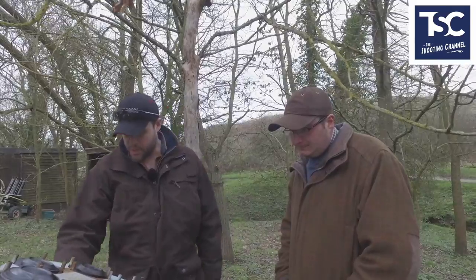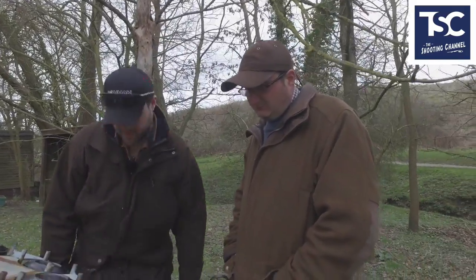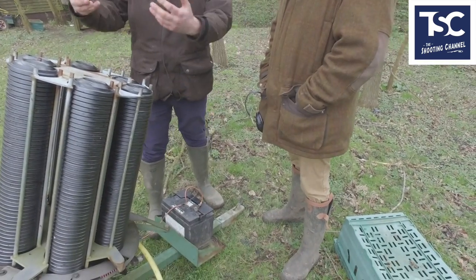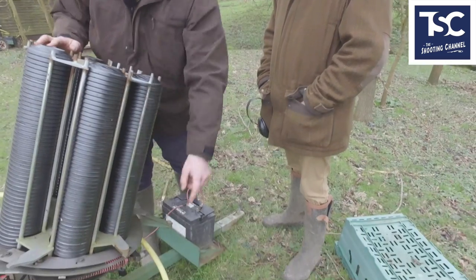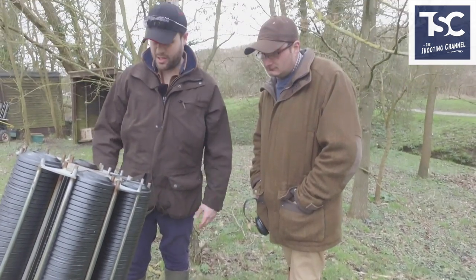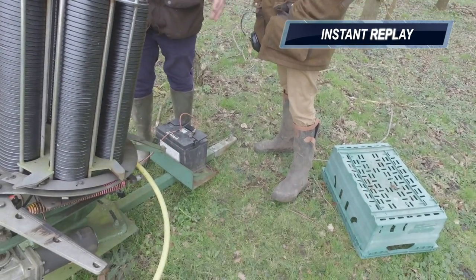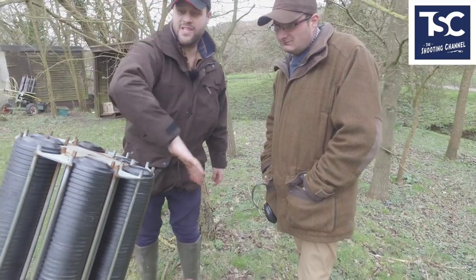You really have to treat a trap with a lot of respect. At the moment the trap's off, but the cables are on the battery, so it always has the potential to be dangerous. What I would do is make sure the main power terminal is off and load all my clays in. While the trap's decocked — meaning the arm's out to the left — you know it's safe and not in an armed position. This yellow ring designates the danger zone.